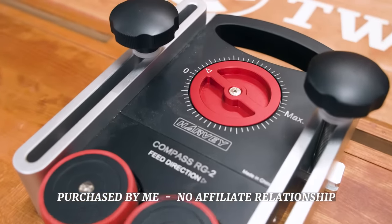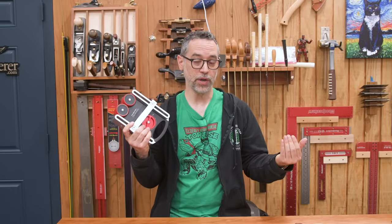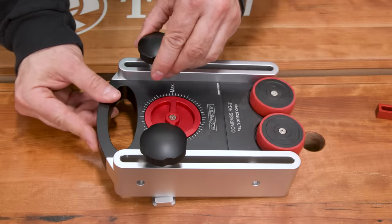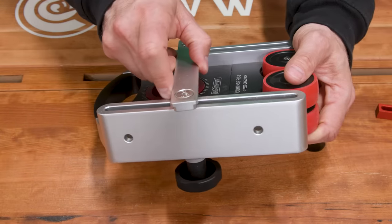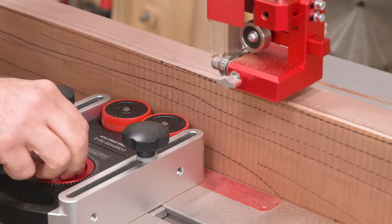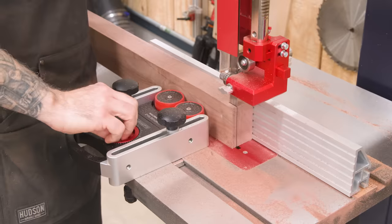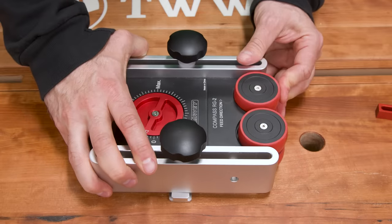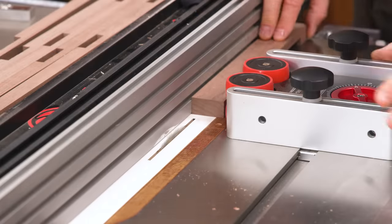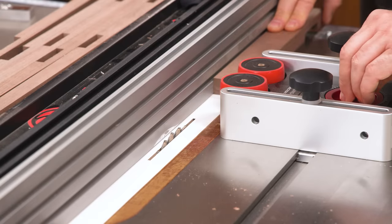And lastly today we have the Harvey Compass RG2 roller guide. This bad boy came as an accessory with the bandsaw I recently purchased and it's compatible with not only their bandsaw but table saws, router tables — just about any tool that has a T-shaped style miter slot. I've been using it mostly at the bandsaw and I've been really impressed. A lot of times when I'm doing a resaw, I leave the surface facing out in its rough state — there's no reason to mill it — so having a feather board with two rollers, each with its own suspension, really comes in handy. I can actually adjust the position of the rollers on the fly, so if my board's thickness changes dramatically I can quickly apply more or less pressure as needed.